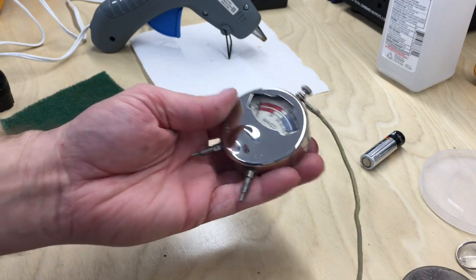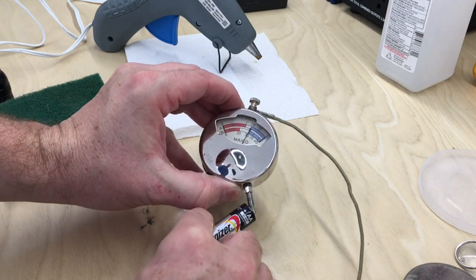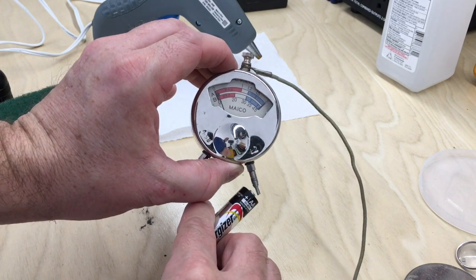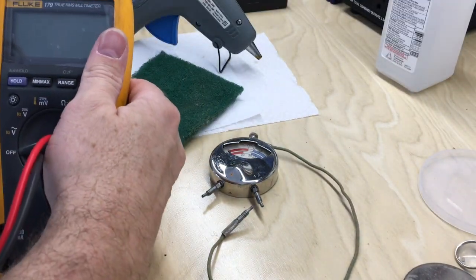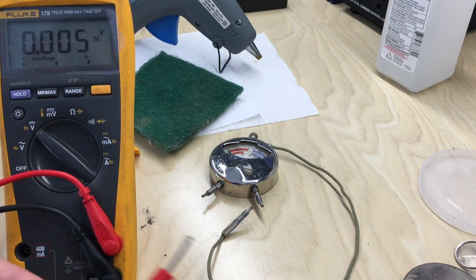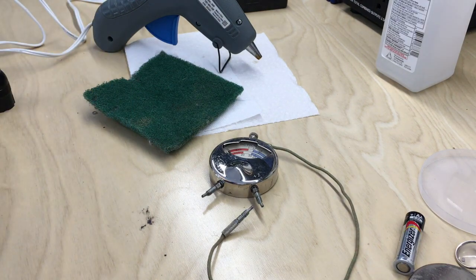Before we put the cover on, let's do a test. Let's give it a check — to the plus two volt, same battery as earlier, showing 1.2. I believe this battery is a little bit depleted. Let me bring my other meter over. The modern meter reads 1.3 — so this battery is depleted to 1.3. The old Mako meter is showing 1.2, which is quite close.